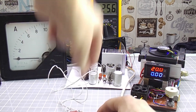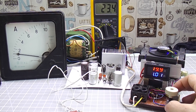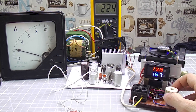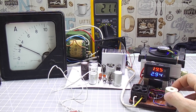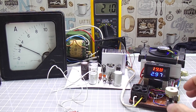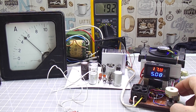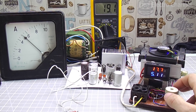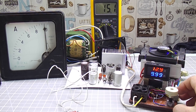At the end, I will set the almost maximum voltage to 20 volts. At 2 amperes, the voltage dropped by 0.3 volts. At 3 amps, by 0.6. Even if you turn the regulator higher, the voltage still does not rise, since the input voltage has also already dropped significantly. The difference between the input voltage and the output voltage is very small. With a current of 5 amps, the voltage becomes slightly less than 18 volts, but the load is still decent — almost 100 watts. With a further increase in current, the voltage drops to 13 volts at 10 amperes.